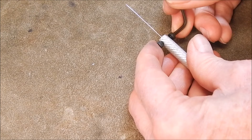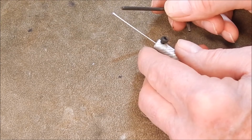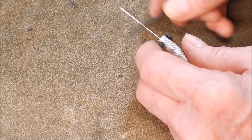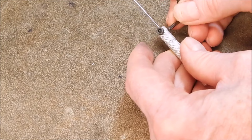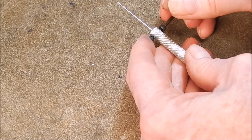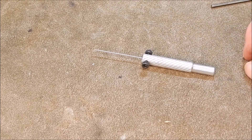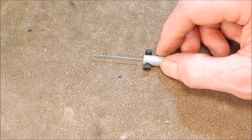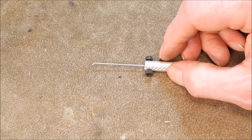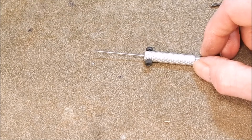I might try to keep my eyes open for a 1.1mm needle, which would be perfect — this is actually smaller than it needs to be for the screws I'll be working on. Plus doing it this way the whole thing is interchangeable, so I can just swap over tips — just find a 1.1mm needle, or even drill it out slightly bigger and put a slightly bigger one in. Lots of possibilities. Grinding the tip was a bit tricky — I did that on the fine grit belt sander then finished it off on an oilstone, and that came up okay. So there you go guys — didn't cost me anything, and it'll be handy for next time the screws fall out of my glasses.